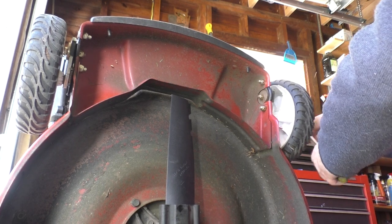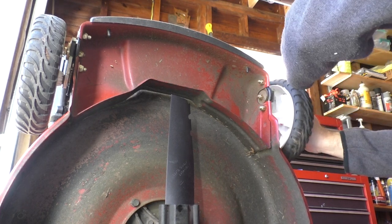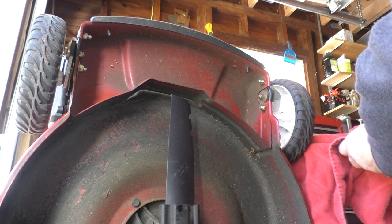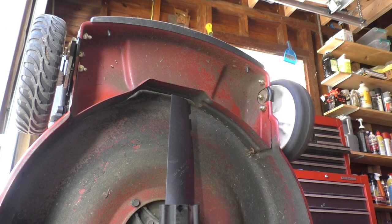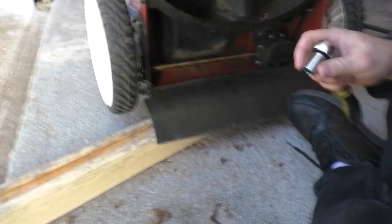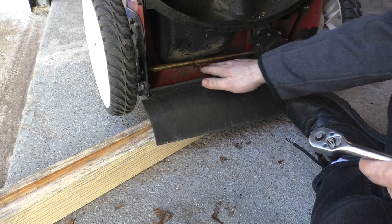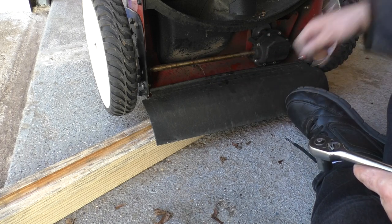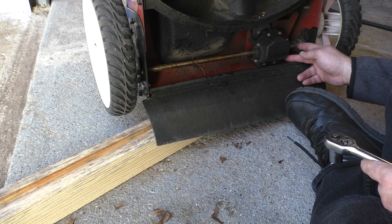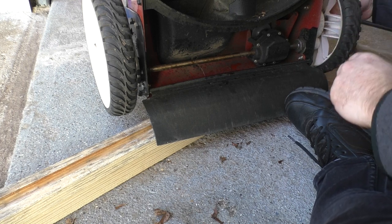While you're under your mower, it's probably a good idea to check for any deck damage, any cracking or fatigue — especially if you have one of the fancy aluminum or composite deck models. You don't want fatigue cracks because they can cause problems down the road. See how smoothly that wheel spins now? All right, the next thing is to pull this shaft out as much as possible. I sprayed fluid film in this machine shortly after buying it. I see there's a little rubber seal that has just kind of fallen off — that's not great, but we'll see how bad it is. I'm going to take the axle nut off.